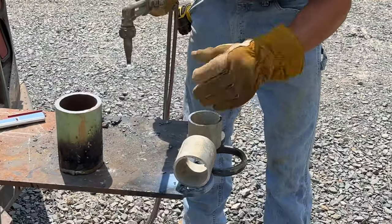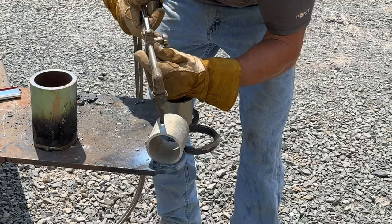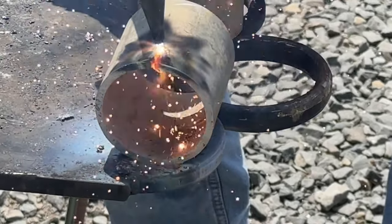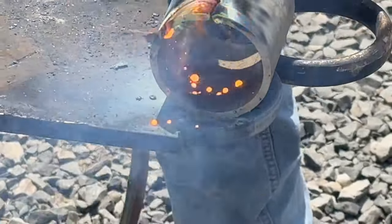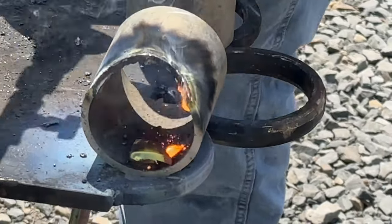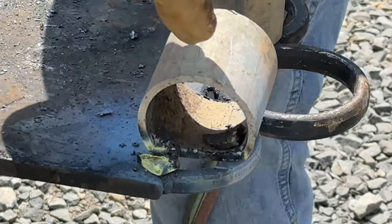Another tip: if you're going to be cutting something that's this tall and you're trying to do it like this, it's going to be hard. So get something about the same height and it'll give you something to go on. I'm going to come down about to where two inch would fit — and this is galvanized, it's going to pop and spit. I'm going to come this way. One side. Then you're going to eyeball that end down — just look down and you can see about where it's at — and start right on top again.